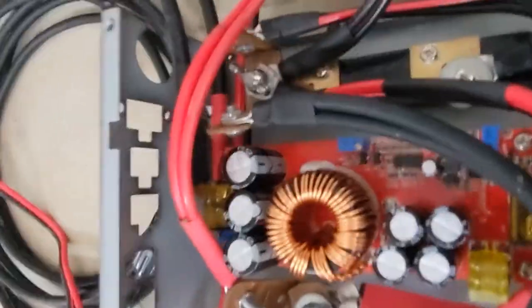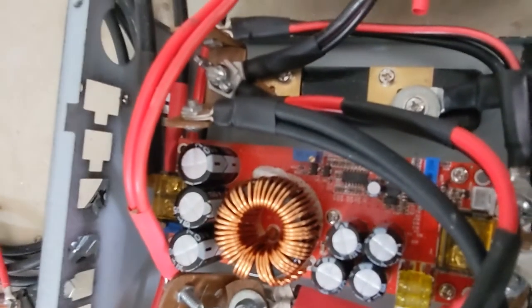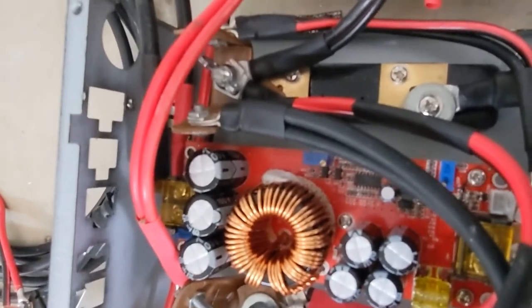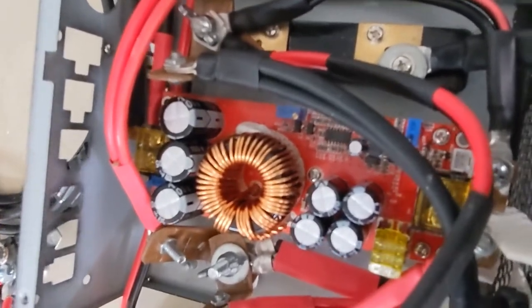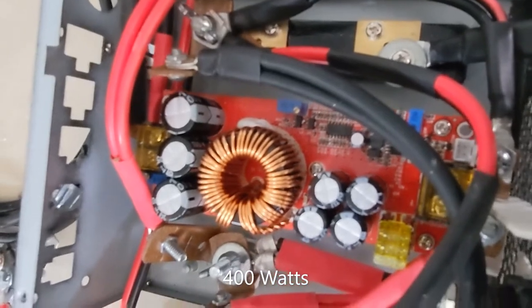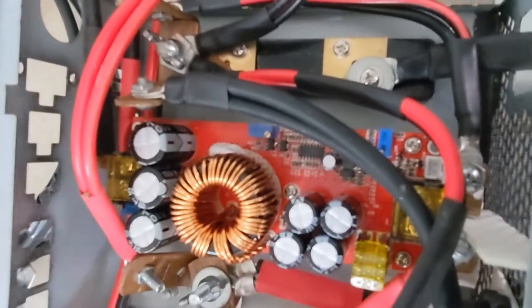That will give us between 450 and 500 watts on the PV line. Theoretically we should be able to boost our 12 volt battery source up to 90 volts and make it usable — if not particularly efficient — on the grid tie inverter, which will, if there's wind, accept electricity from the wind generator. Otherwise at night you'll get maybe 400 watts. So that's a bit of the experimental part of the project — we're not really sure how well that'll do; it depends on the MPPT settings inside the inverter, but you should get some level of decent efficiency. If you get anything more than zero, I suppose that's a bonus.